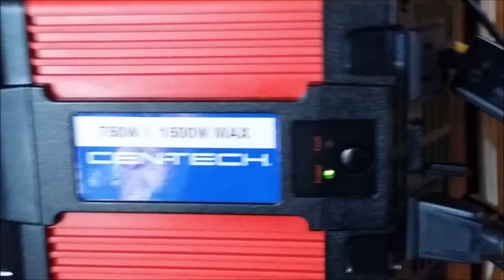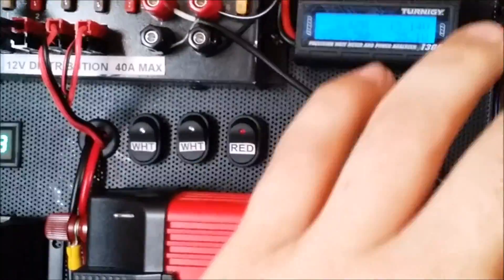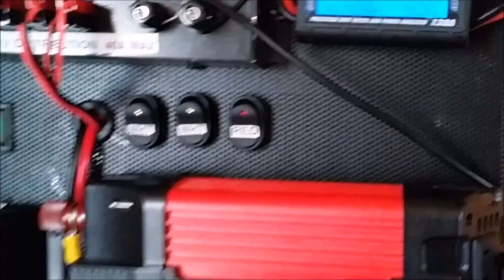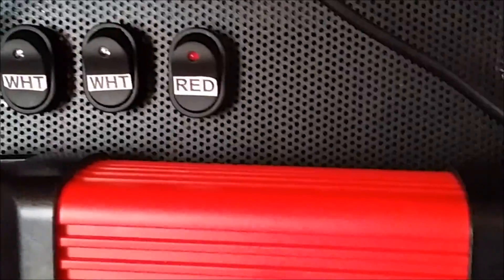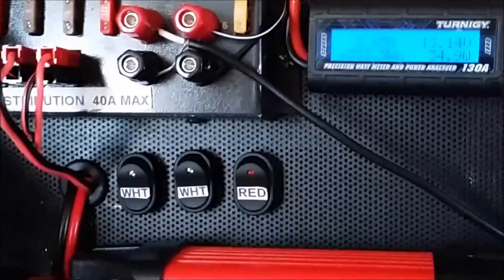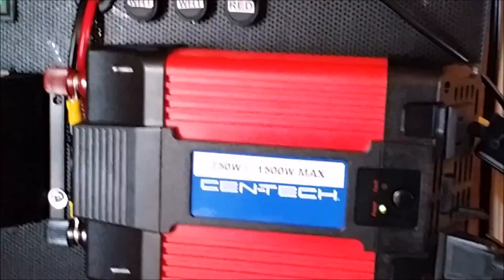Another circuit is running a small thermoelectric cooler that keeps some bottled water out here. There's also a meter here that shows me all the power consumption being used from this panel. Right now I've got a 2.6-amp load and battery voltage at about 13.1 volts — that's a little low because of some loss through the cables feeding this distribution system, but not too much loss overall.